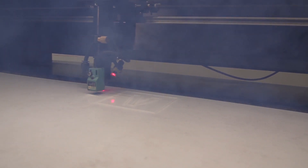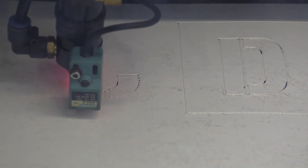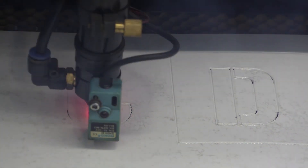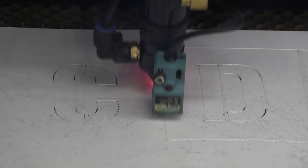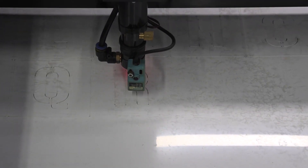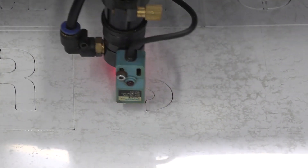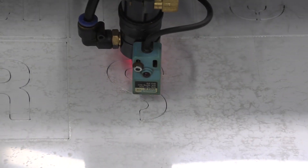When you are laser cutting ABS you have to be very careful of the fumes — you must not breathe them in at all. You also want to try and stay away from sharp edges, purely because ABS is a plastic and not acrylic or perspex. When cutting slowly, some edges might melt back to each other since it's hot melted plastic that can fuse. Additionally, sharp corners will likely come out a little skewed and won't be exactly correct, because the melted plastic doesn't solidify fast enough at a straight angle. Try to use rounded corners to prevent odd shapes.